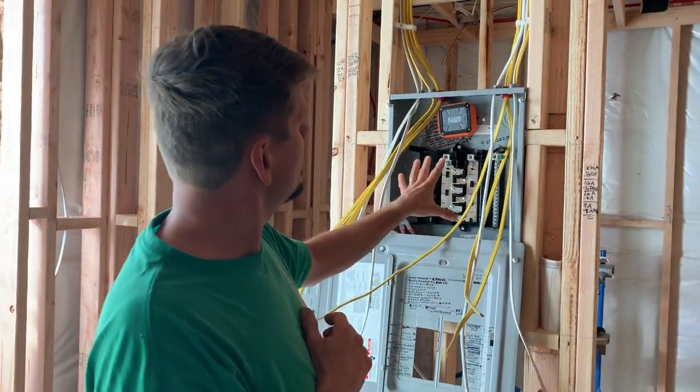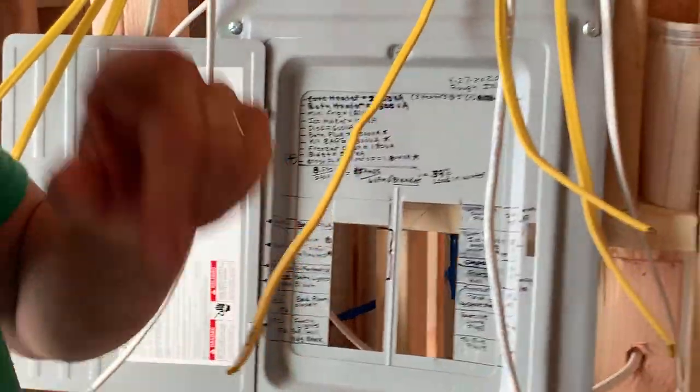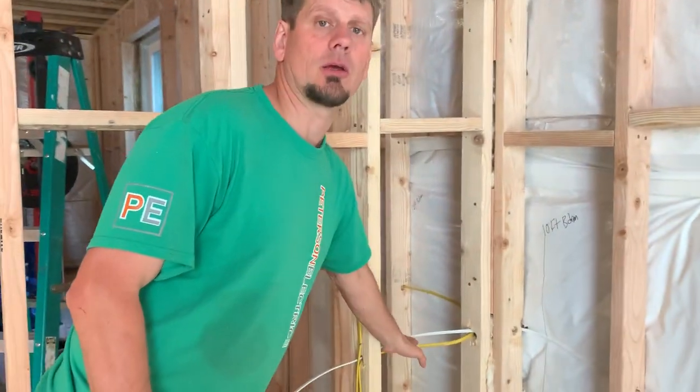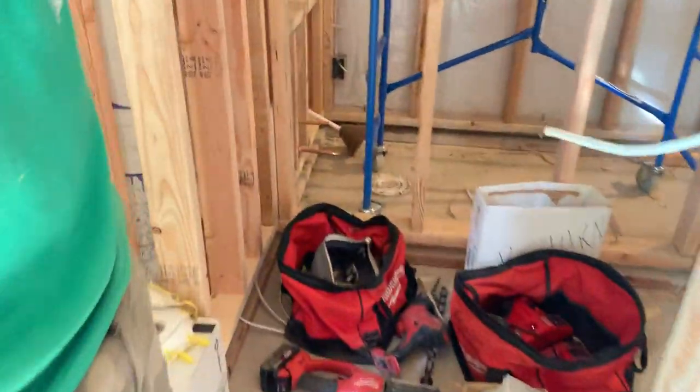Keep in mind when you're setting your subpanel and looking at your load — we're looking at what we're actually putting in. I think I'll do one more video because this is getting long, but this was the layout. It's a great basement — very small, universal, it'll sell well. She's got a permit. We've got cove heaters going in, not baseboard heating down low to take up space. We've got ceiling fans, we've got an exercise room, and we made sure the wire was bigger — yellow 12-gauge instead of white 14-gauge — which is 20-amp versus 15-amp circuits.